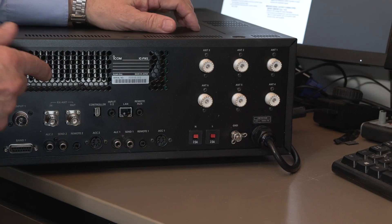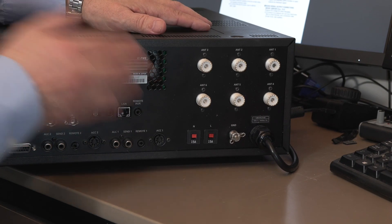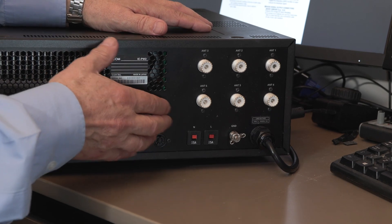This linear will run from 90 to 132 volts at 50 or 60 Hz, but at that input it will only provide 500 watts. For the full kilowatt, you need a source of 180 to 264 volts at 50 or 60 Hz. So if you're in the United States, you'll need the higher voltage outlet installed to get the full kilowatt — not a problem if you're in the UK or Europe.